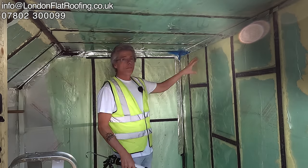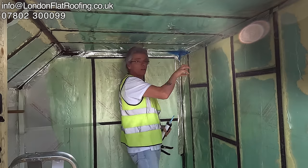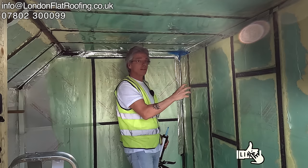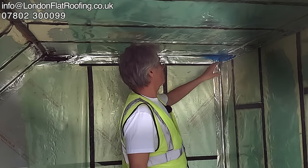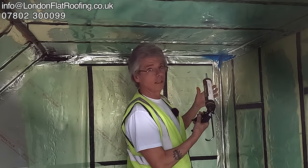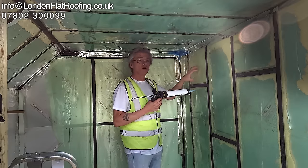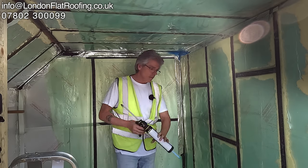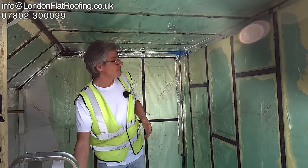In the corner here you can see where you're doing penetrations through — if you've got pipework coming through a wall, you go around it with your black butyl tape all the way around the penetration. It might be a plug hole or any kind of pipe coming through the wall. You can seal it as best you can, but if it's really difficult, they give you this particular product. I had many folds here, so not only did I seal it with the butyl tapes, but then over the top I went around it with this product which really seals it in. If you had pipework or cables coming through you could use it here, and I'm also told you can use it on dusty concrete floors to ensure a good junction.